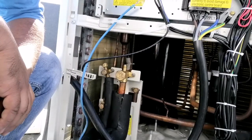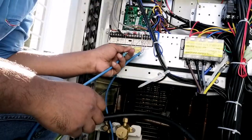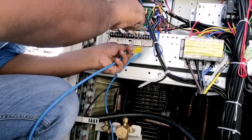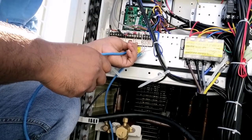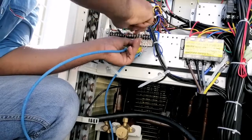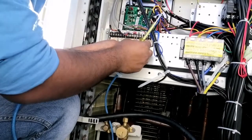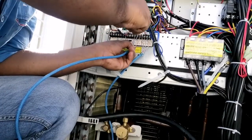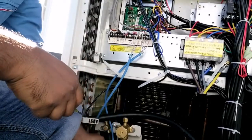Now we will connect the main PQE to our master. Let's connect the PQE now, because this unit we have to keep for a minimum of eight hours for preheating. I have kept this unit for preheating a minimum of eight hours and our compressor is already preheated — our oil has gotten heated. For VRF and VRV we have to do the preheating for the compressor oil a minimum of four to six hours. Our PQE is also connected now.